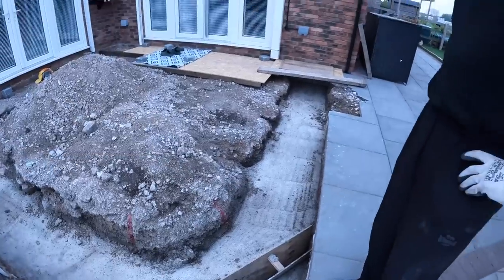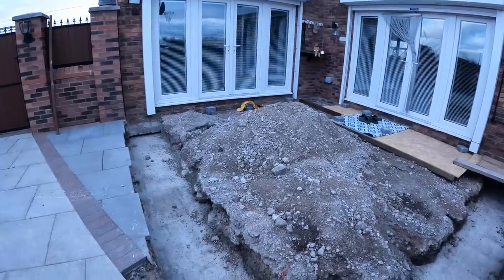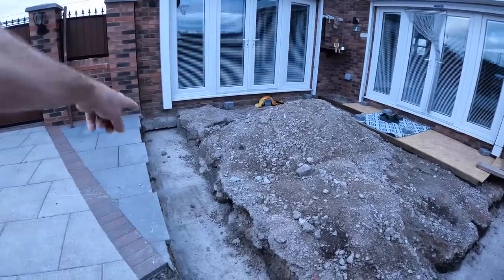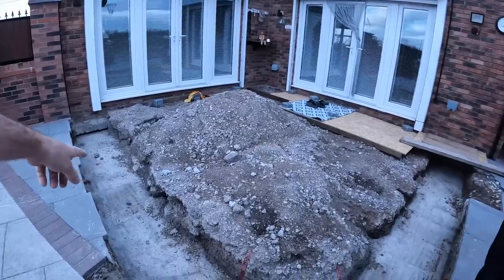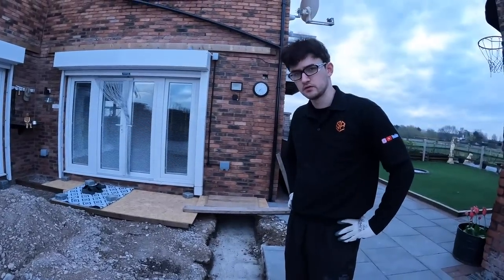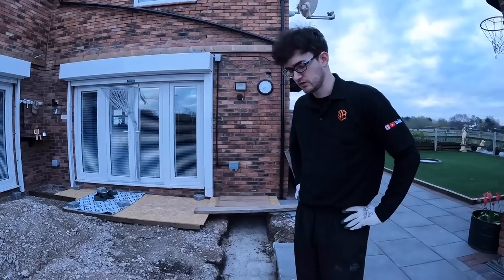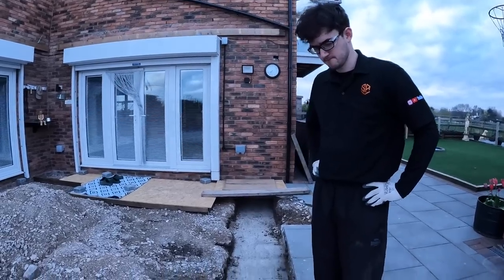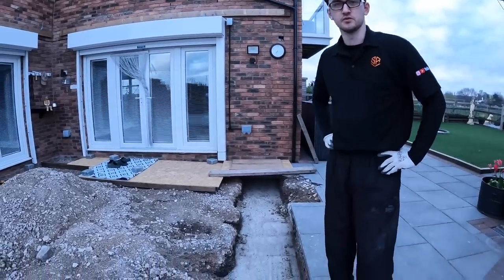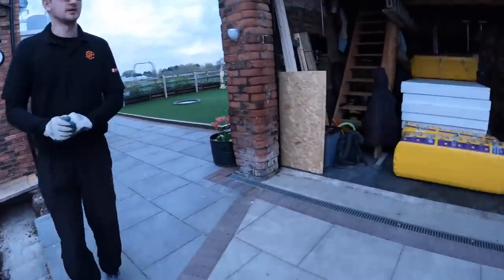And we've got big lintels to go in there, so we're spanning across the bad ground. Even though we've got 2 foot of concrete with reinforcing in it, we're still going to span that. Quick question, how's it going to come out? Take the wedges out. The wedges are underneath as well? They'll probably just pull out then. If not, we'll just cut the top off. It'll rot away, but it won't do any harm. Like we had to do with our previous poly spot board. Yeah. So there you go.